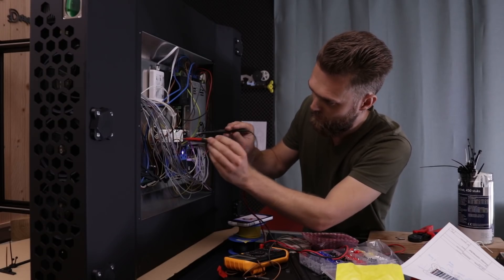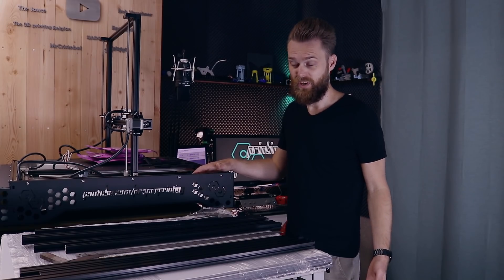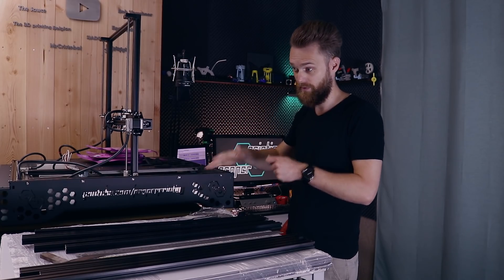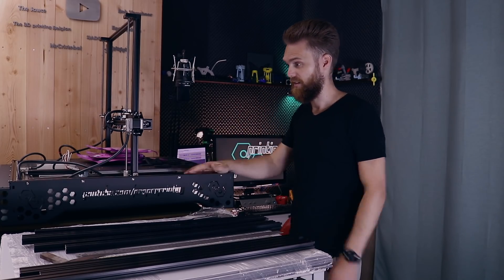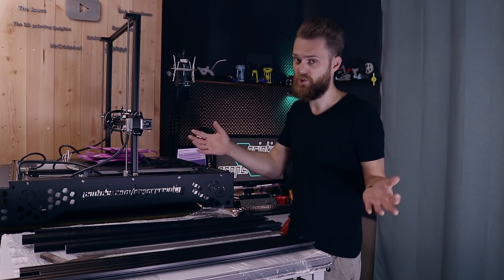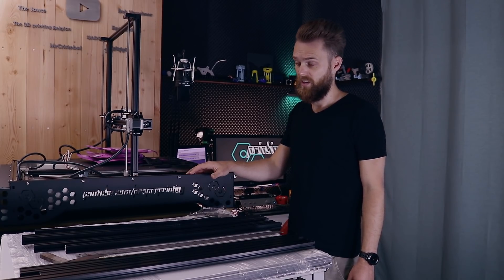Through this controller to ground and everything should work fine. But the problem is I didn't get that controller to work with the app, and so I got a bit impatient and I just connected the 5V directly to that fan so I would at least see that LED lighting up. Well, it lit up — pretty short — and then that famous smell came from there.